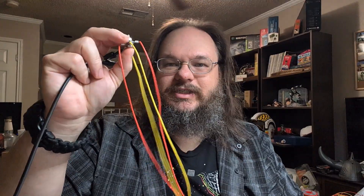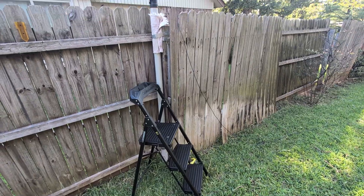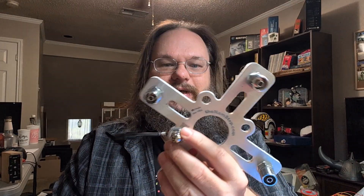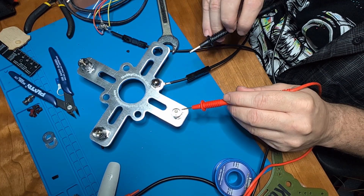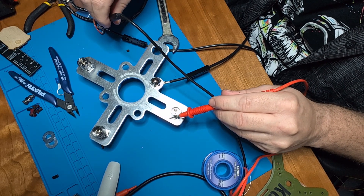The final form: here is the counterpoise section of the wires — four 17-foot cables ran out at different quadrants. Then we got the jumper to the Anderson Power Pole, connect the Anderson Power Pole, and that's going to go to the ground while the top of it goes to the Skyhook. I swapped out the Skyhooks — this Skyhook is going to be connected to the wire. Just one final test: we're going to touch the ground here to here, get a beep, and then this there to that there — it beeps. I think we're ready to go.